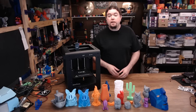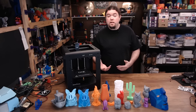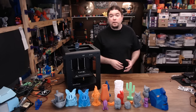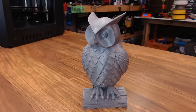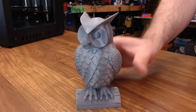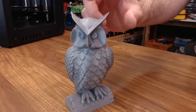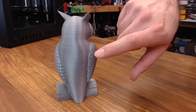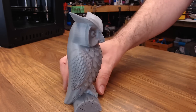So there's a look at the printer and some of the experiences I've had while testing this machine — but how does it print? Some days it'd print really well. It seemed to really depend on the type of filament you were using and the heat settings for that filament. This owl is probably a pretty good representation of what you can expect if you have everything tuned in. It looks pretty good — a little fuzzy because of the part cooling. If you take a look at the back, you can see some striping introduced by both the ball screw and the stepper driver being used. But all in all, not a bad print.